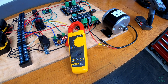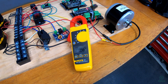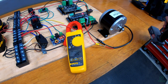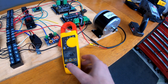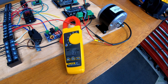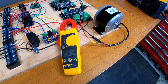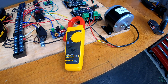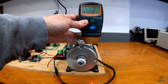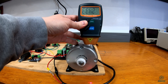Let's look at how much current this draws. We have the power wire into the motor driver clamped and we're reading just under 0.1 amps. Firing up the motor to full speed, idle load is about 1.2 to 1.3 amps. Switching to max tracking mode and resetting — at startup we got about 2.7 amps, and going back and forth we're up to about 3.4 amps. Not a lot of draw, but that's expected without any load on the motors. Looking at RPM on roughly 20 volts, we're getting about 2400 to 2430 RPM — pretty quick but not too crazy to gear down.